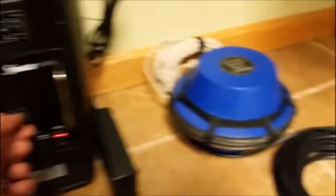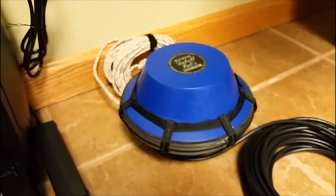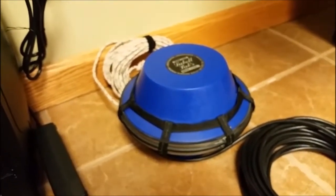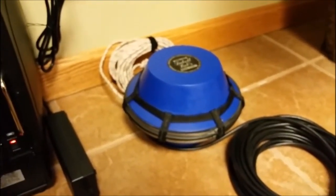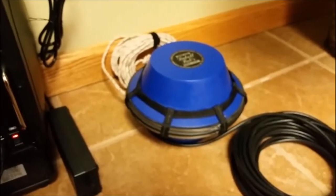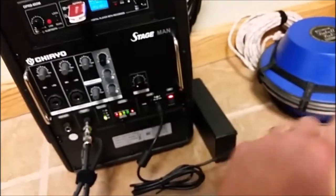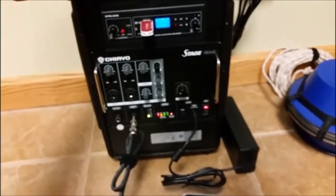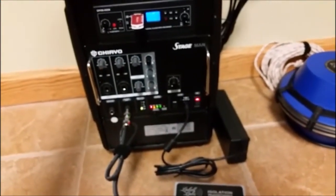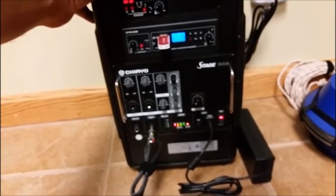The speaker sounds a little funny in the air right now — it's designed for underwater use, that's where it sees its proper impedance. You do want to use the speaker at a minimum depth of six feet and a maximum depth of 50 feet, and it's okay to put the speaker on the bottom of the pool. Always keep the sound system a minimum distance of 10 feet back from the side of the pool — that's a national electrical code requirement and just a good idea.